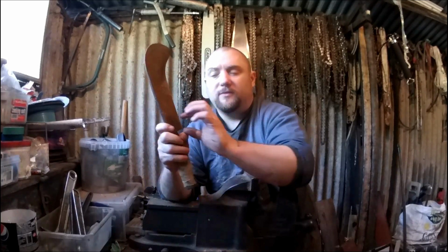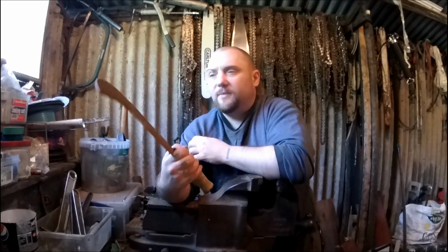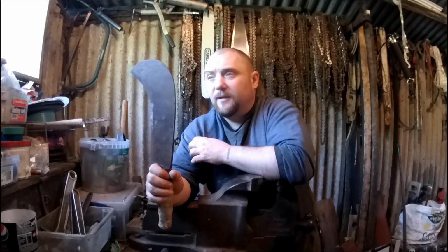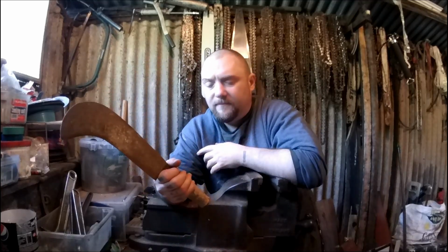And on one side, obviously, you'll see them on there, and on one side it'll look better. But I think that's how they would have done it in the old days if they didn't have the capability to forge weld it on, or have it already on there. You would have had to drill holes and rivet the blades on, so it'll be quite traditional in that way.